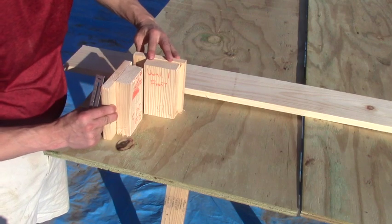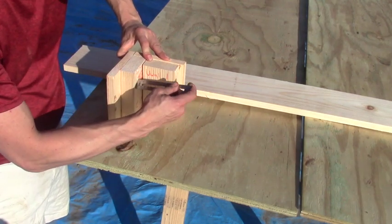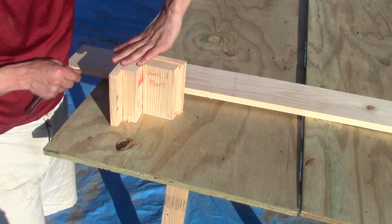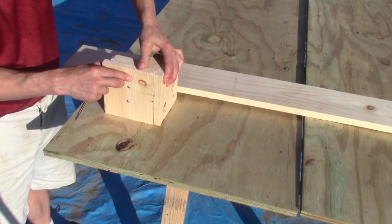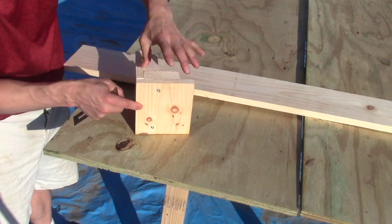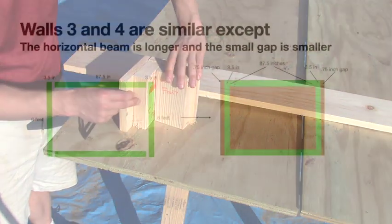So this is my inside wall. It's going to go just like this. And if you remember, we drew those pilot holes. So we'll be securing this stud to that stud. And we have a nice tight seal. If you look, I'm going to turn the whole thing like this. It's beautiful. So nice and tight. And that's the 3/4 inch overhang. We'll line it up on the plywood on the other side. So there it is, boom.